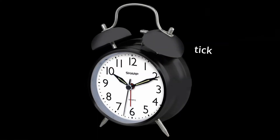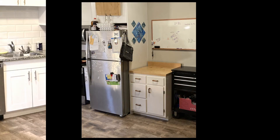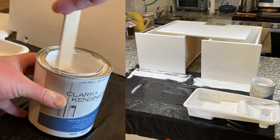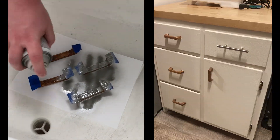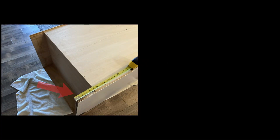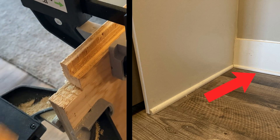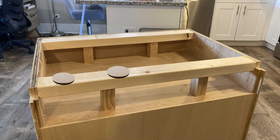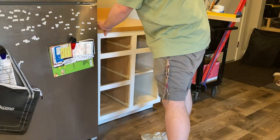The clock was ticking. I needed to get to work fast. I disassembled and cleaned out the whole thing and test fit it in the apartment. Since it was originally part of a kitchen, it matched up perfectly with our kitchen at home. I repainted the whole thing a fresh coat of white and painted the handles to make them look less dated, which was a lot cheaper than buying matching handles. To maximize space, I cut out the bottom corners so it could sit flush against the wall, since there was molding preventing it from doing so. I then reinforced the bottom to make it more sturdy and to give me room to put felt sliders, since being able to move the whole thing easily felt like a worthwhile investment.